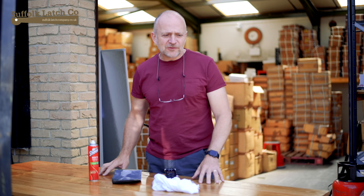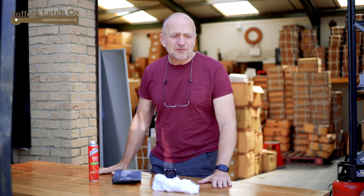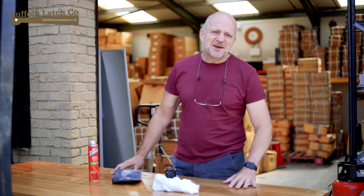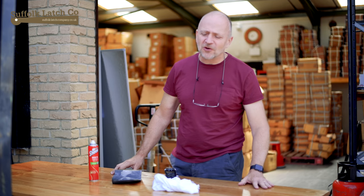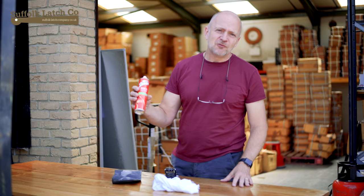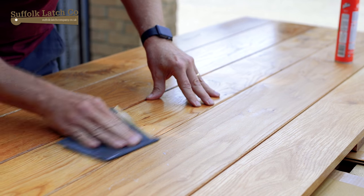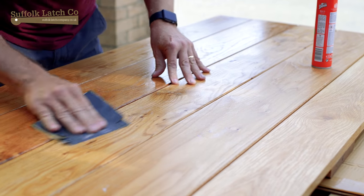It's now been 24 hours since the last very thin coat was applied — we've got a total of seven coats now. I'm very pleased, it's well covered. But there's one slight problem and one more process to go through. It feels a little, how can I say, jammy — a little bit raised and slightly too shiny. So the next process is going to be using a bit of household furniture polish and 600 grit emery cloth, and go with a very, very light sanding — and I mean very light. Anything too hard will start cutting through the corners into the original timber.